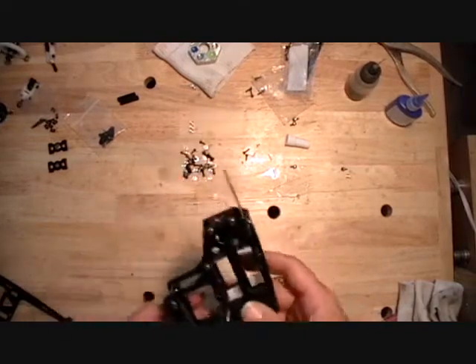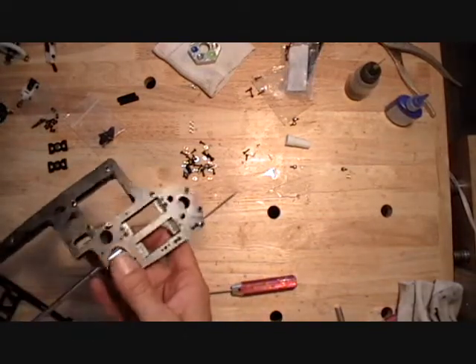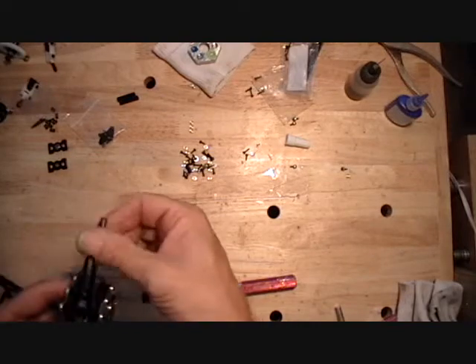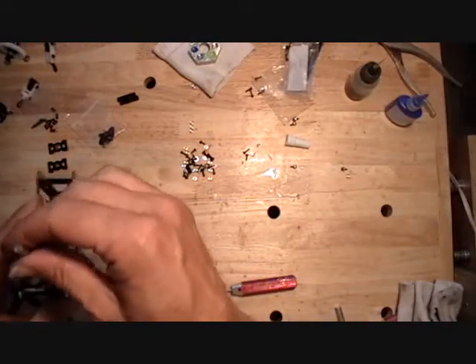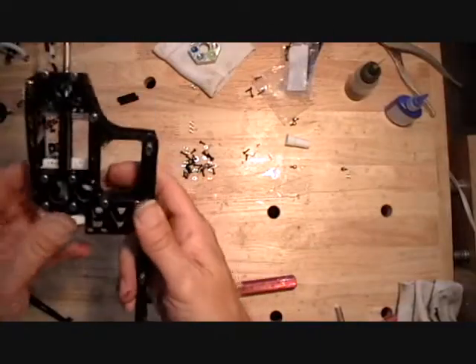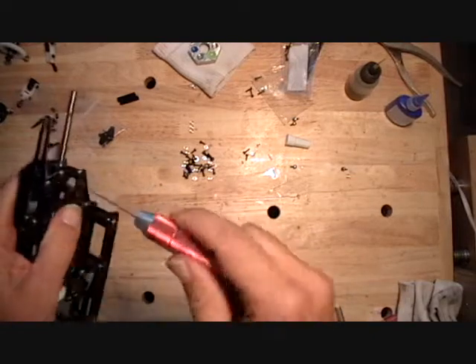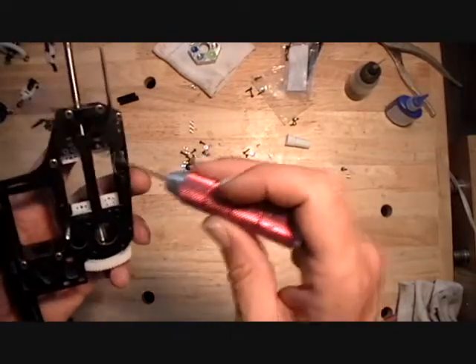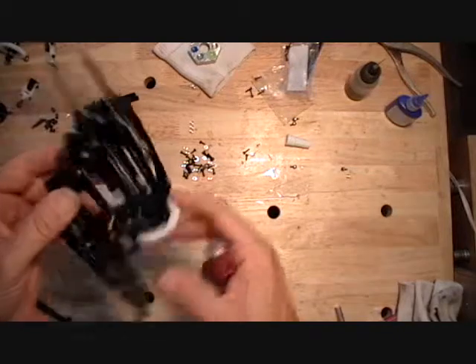At this stage you can install your main shaft. This is the left side frame, and the reason you do that is to get all these bearings in line. You want it to freewheel on the left side so the blades approach the wing. Once you get that main shaft in there, you can go through and tighten up all these screws. The shaft should be free to slide, which means those bearing blocks are in line.